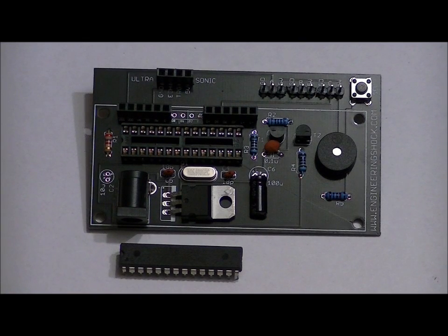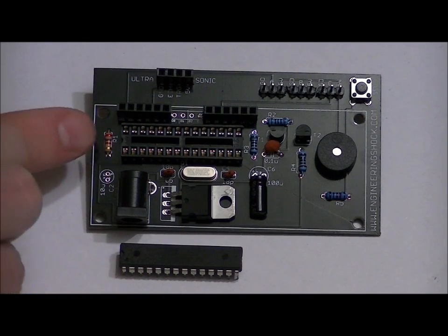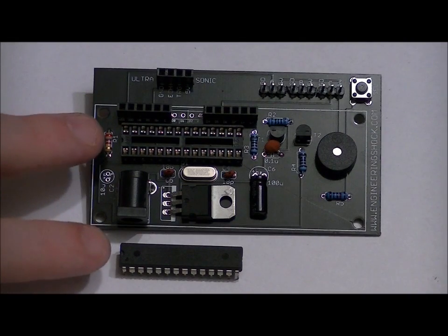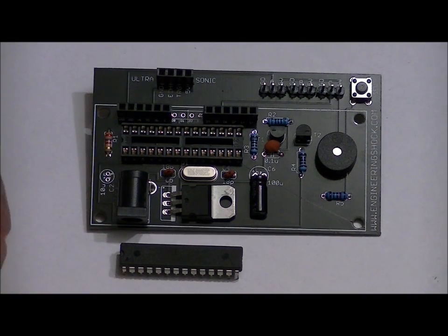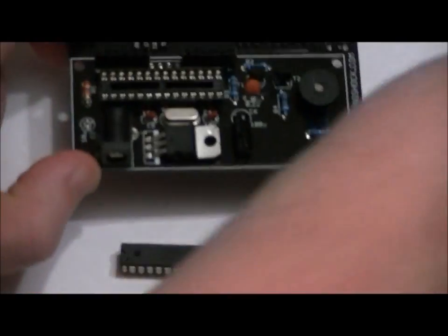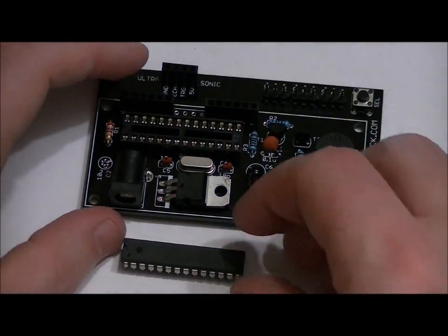With the LCD ready, we're just about ready to mount the LCD, but we want to make sure we place our programmed chip in here first. Now, there's a notch on the top left of the chip. Remember, there was a notch on the left-hand side of the DIP socket from this perspective. You want to make sure that the notches are both facing left from this perspective. Now, I'm going to have to reach around the camera here. Hopefully, I don't mess anything up.